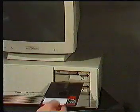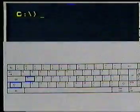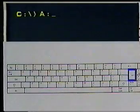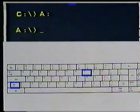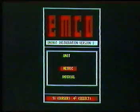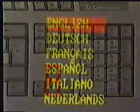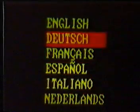Stop. Here we're showing the software being installed. Insert disk. C appears on the screen. With these two keys we go to drive A. We then press the colon key and the enter key — the blue one here on the right-hand side of the screen. A capital A appears on the monitor and we enter I for installation. Press the enter key again and the installation of the software program starts to run automatically. With these cursor keys, we move the bar to the language we're using. In our case, we move to the line English.